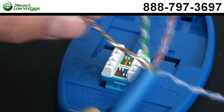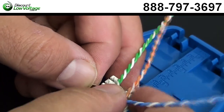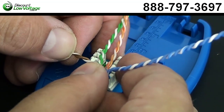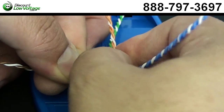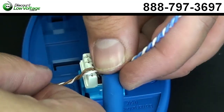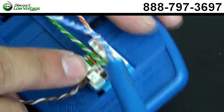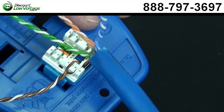So as I said, we didn't untwist the pair from the very bottom. What we're going to do with this peak is start in the middle, check the B pinout on the jack, and then loosen the CAT 6A pair just a little bit. With that peak helping us separate the pairs, you push down on the other side and it slides right in. That way the pair stays as twisted as possible, which is critical when you put your certifier to it to get the best possible test results.